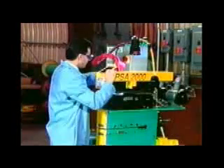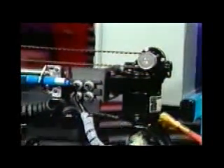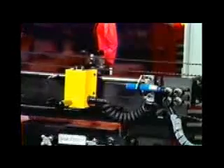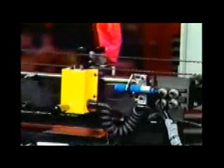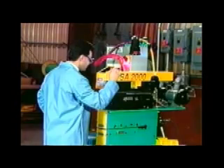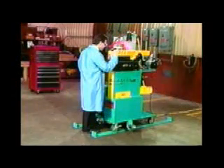The weld torch is then driven by a variable speed DC motor. Notice the simplicity of the timing belt drive — this assures that the weld carriage is basically 100% maintenance free. This timing belt is also continuously driven to initiate torch movement the moment the arc is established, effectively eliminating the possibility of burning the edges of the strip. As the torch gets to the rear edge of the material, an easy access adjustable proximity switch is positioned so that the torch always stops automatically at the same location, assuring consistent repeatability at the rear edge.